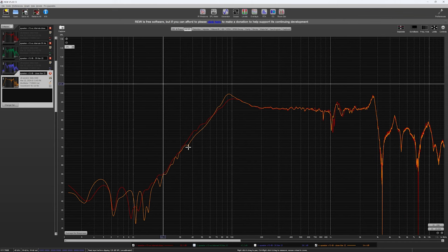So there's a trade-off here. The red box actually stays louder, lower. I'm assuming that's just due to the increased internal volume. That diffuser does take up volume, so it would make sense that it sacrifices some performance in these lower octaves down here. But overall, that diffuser does help give it a better peak performance here at that 90 hertz range. So it's not exactly perfect, seeing as how you want more of a flat response, kind of a taper down response, but it is showing improvement by having that diffuser in there.